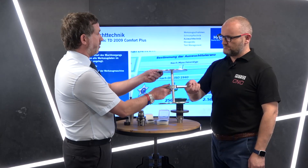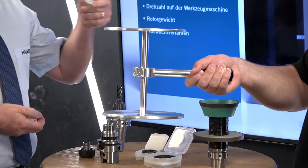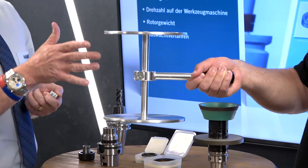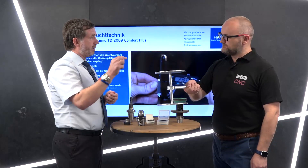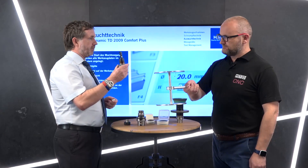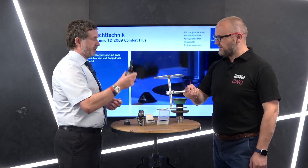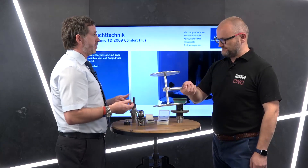There's no movement in the machine spindle, no movement in the tool holder. We're going to add a series of weights. This is quite a large amount of weight — 30 grams — and we're only spinning this at possibly 10–20 revs. To demonstrate, this weight will have the same effect as adding 0.3 grams to something spinning at five to six thousand revs.